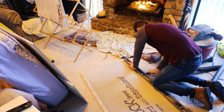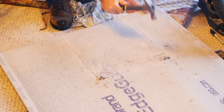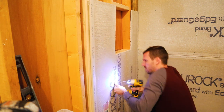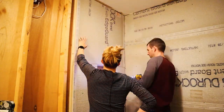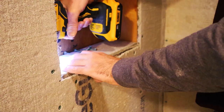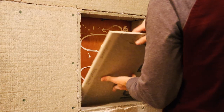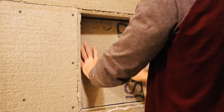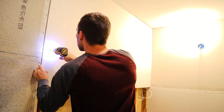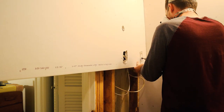Cutting cement board is as easy as scoring it several times with a knife — you don't need a special circular saw blade. For weird cuts like holes, make a bunch of cross cuts with your blade and hammer it out; this makes a bunch of weak spots where you want them. For the cubby bottom I was sure to slightly slope it down towards the shower, and I'll do the same with tile later so any water that ends up back there will just drip down into the pan. I did a terrible job cutting out these outlet and light switch holes — looking back I should have taken more time because now I'm taping and floating all of my mistakes.